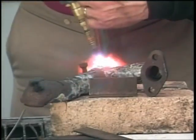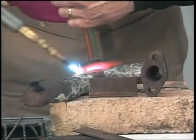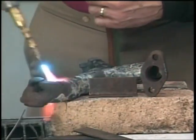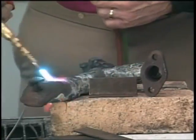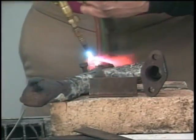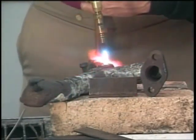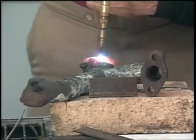Now, when I get through here, I also want to show you just how nice the machinability is. And I'm also going to not take the time to heat it up as much as I should, but you want to heat that whole thing up. I've heard anywhere from 400 to 800 degrees. I've even known some people to heat it up to 1100, which seems to be awful warm. But just heat that whole piece up real good, moving out from actually where you welded it right there.